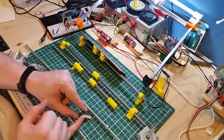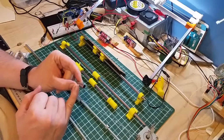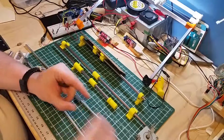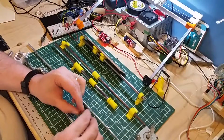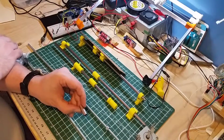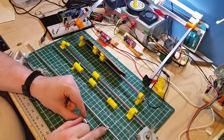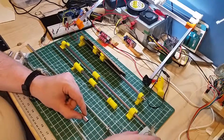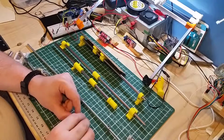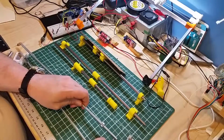I'm going to take this, which is self-lubricating bronze. It's been impregnated with oil. And I'm going to cut through that. It sits perfectly on here. And I'm going to use the top half of this bushing at the top of the printer to hold up there. And the bottom half, I'm going to use it below the collet into a 3D block, so it'll be below the collet and above